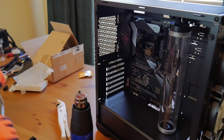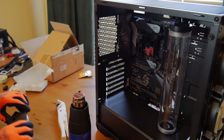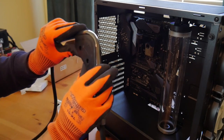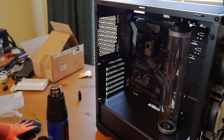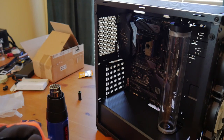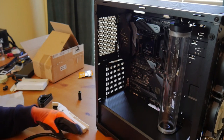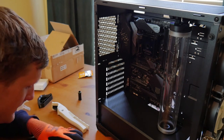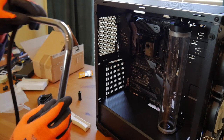Usually I'll lay it on the table and bend it around the piece I want to match it to. I didn't go too fast — well, maybe a little fast there. I just realized my tool is a little messed up — I'm not even sure if I left it near the heat gun last time. So we're actually free-handing the 90-degree bend here and holding it until it cools off and hardens. Our bend's not too bad, though it's a little rough up on the corner — maybe we'll redo this 90 — but it's pretty simple and you can get really used to it quickly.